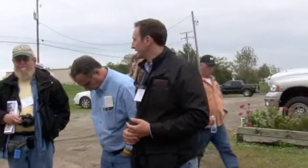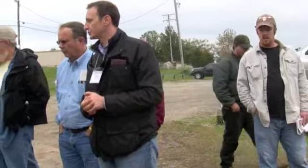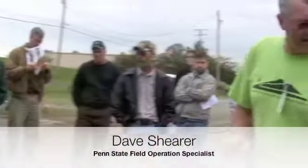Very easy to maintain, very easy to operate. And that's what we did earlier, just to show. If you want to go more into the technical side of the compaction stuff, that's here. You can see there's about 4 inches of fluff. They probably went down into this surface about 2 inches. We didn't want to go real deep. It'll go 6, but we didn't want to go real deep because we're not quite sure what's under here.